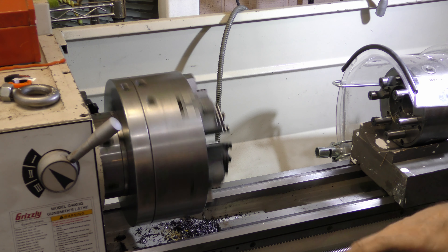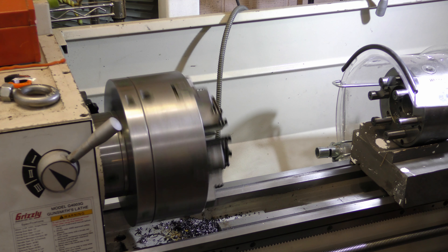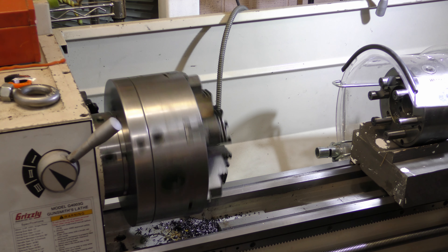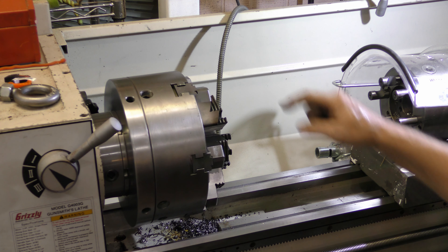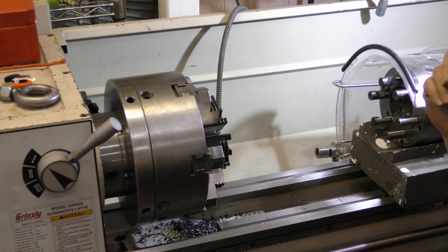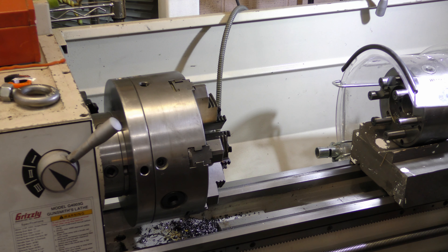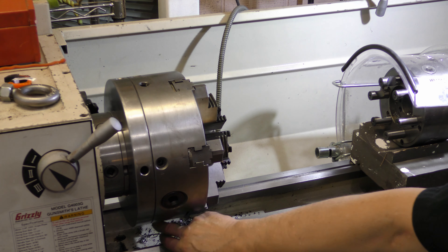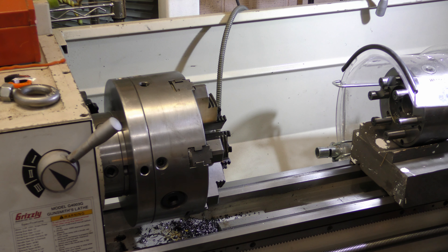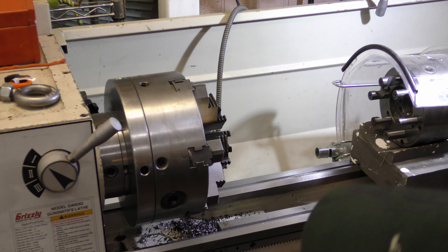Now I've got this much room here, but you can see if I run a jog very far I'd be hitting the ways on this lathe. It's a gap bed lathe, but if I ever pull them you can never guarantee the accuracy of that again. They put the plug in it and then they grind the ways, and they'll remain accurate unless you pull them. Then you may or may not ever get that part of the bed to be straight again. But that's on the slow speed.